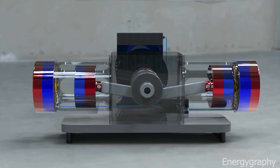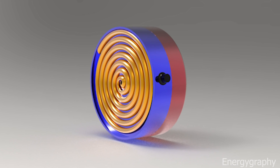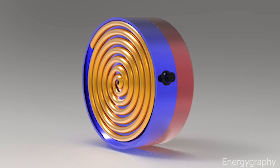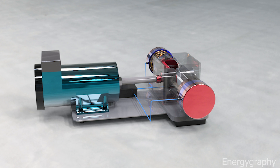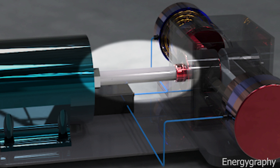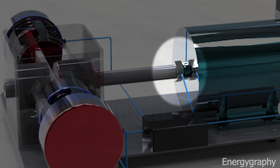The magnetic pistons are made from neodymium magnets and fixed magnets. The most important new part of this generator — the key change in this version — is the use of electric magnets. The electric magnet creates a positive field opposing the permanent magnet and neutralizes the force of the permanent magnet for a short time. The generator is connected to the motor by a composite shaft, and there is a control box with an electric circuit that uses a sensor to control the electric magnets.